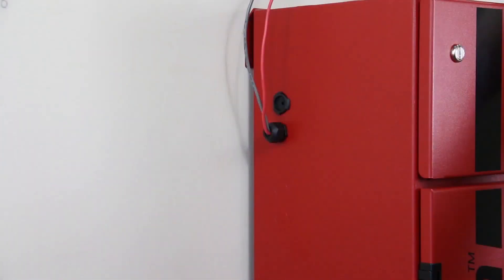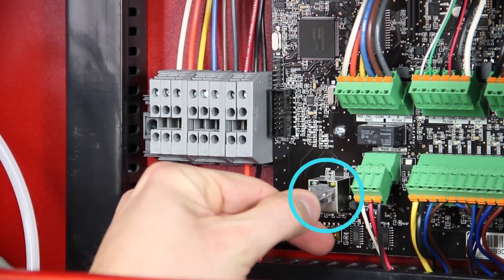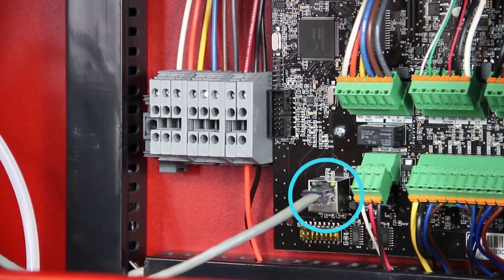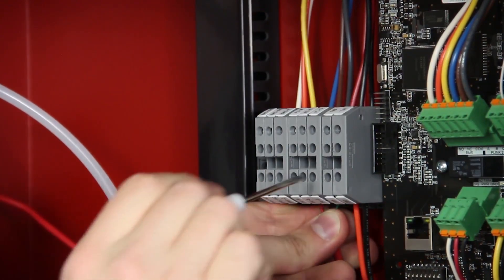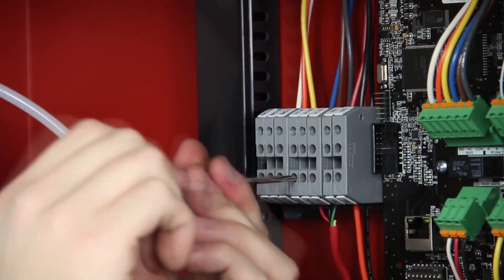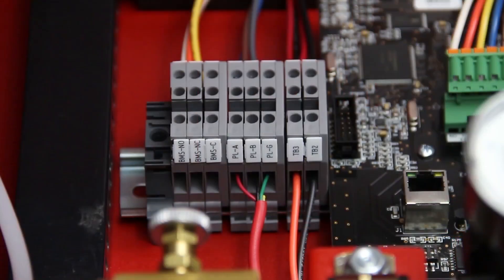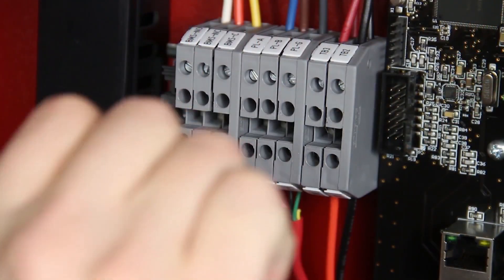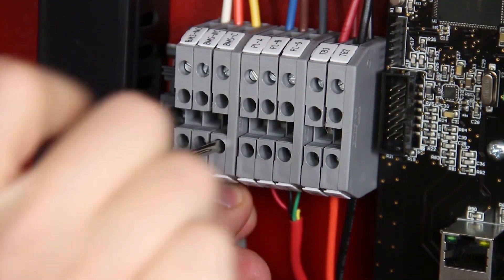For optional internet connectivity, wire a Cat5 Ethernet cable using a half-inch knockout on the left side of the cabinet to the Ethernet port on the intelligent controller on the inside of the nitrogen cabinet. If an Intellipurge nitrogen purge valve is being used, wire stranded three-wire cable to the appropriate P-link terminal blocks next to the controller using a three-quarter-inch knockout on the left side of the cabinet. Using the same three-quarter-inch knockout on the left side of the cabinet, a Form C relay is available to wire any building management system to the BMS terminal blocks.